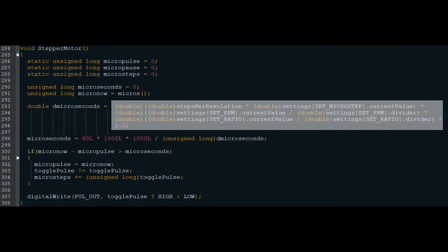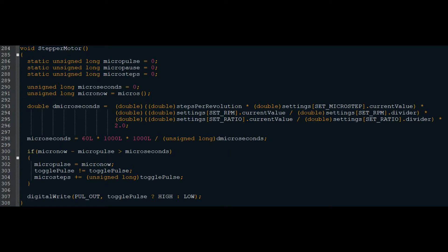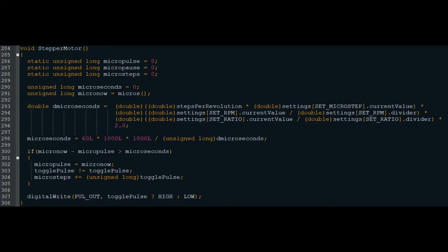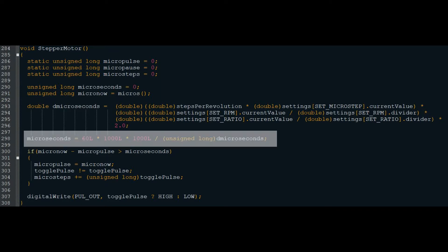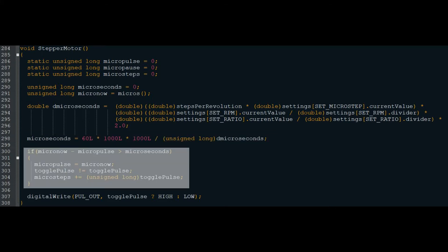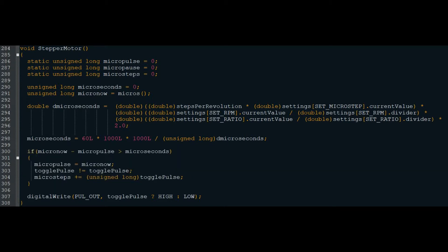The code to create a pulse is pretty straightforward. To get the correct timing for the pulse, we first start with our steps per revolution. According to our datasheet with a 1.8 degree step angle, we will need 200 steps to make a full revolution. Next, we multiply by the number of steps the controller is set to — in this case 4, because we're doing quarter steps. Then we multiply by our desired RPM and gear ratio; the gear ratio for the CNC fourth axis is 6 to 1. Finally, we take this value and divide it by the number of microseconds in a minute. This final number tells us how long we need to keep the pulse high and low to get the desired RPM. Now coders, I intentionally left in a bug for you to find — and I can promise you it took me more time than I'm willing to admit to find it. Even though it is syntactically correct, it should have been written differently. The crazy thing is, the compiler didn't even give me a warning.